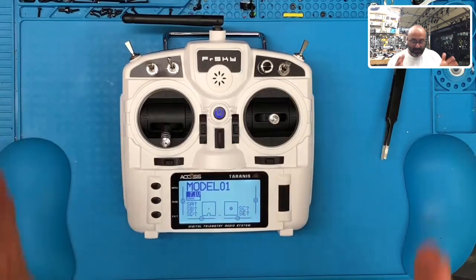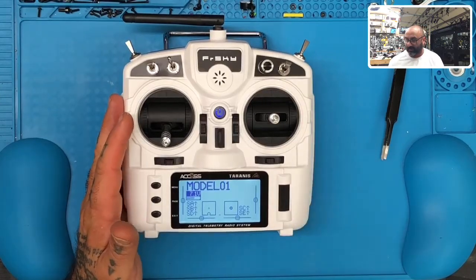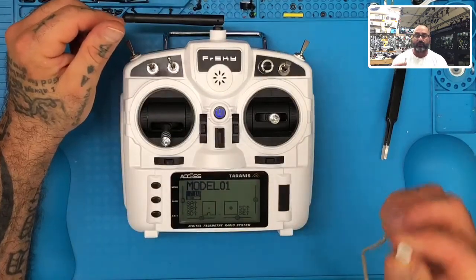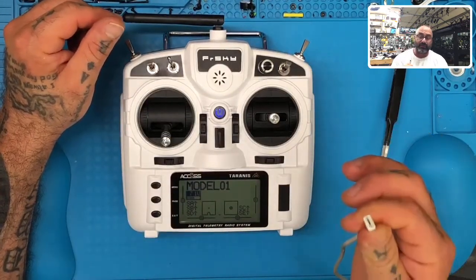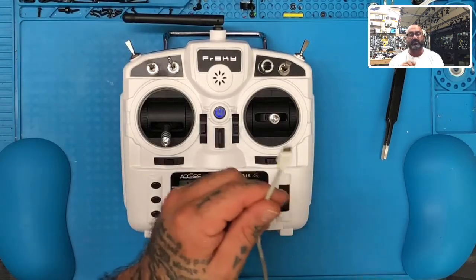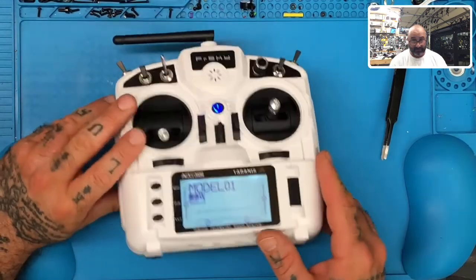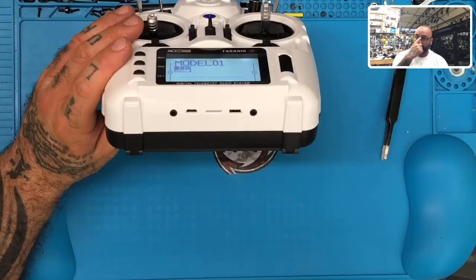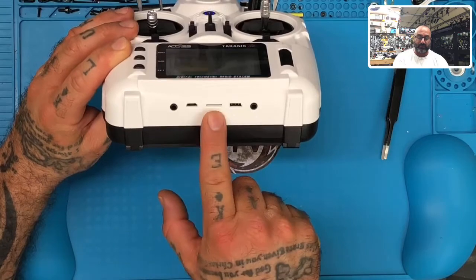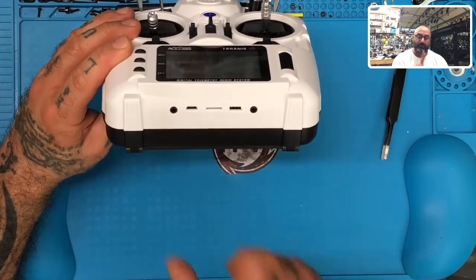One of the things we want to do is update the radio. You're going to need a micro USB cable — something like this. If you have an Android phone it's the kind of thing that charges an Android phone or many other USB devices. The only difference is you need the data cable, not just a charger. If all you have is a charging cable it won't work because you need to send data to the radio. Take some time to go get one if you can because you'll need it to update the radio. The first slot on the bottom is your micro USB slot — this is what you'll use to plug your radio into your computer.